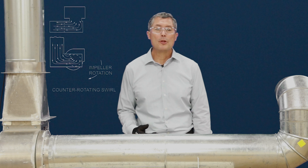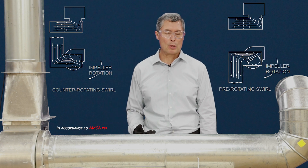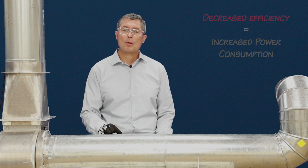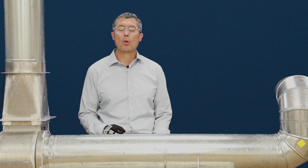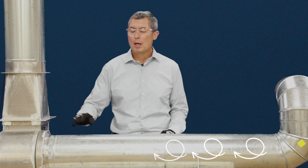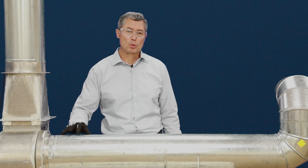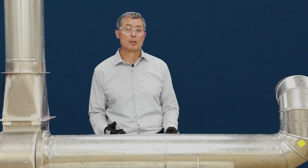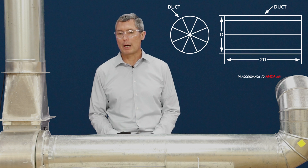Final thoughts on corkscrews. Corkscrew ductwork does affect the way a fan performs. If you counter-spin the air, you'll have much better performance than if you pre-spin the air. However, if you counter-spin the air, we just have to make sure that we compensate for that with a safety factor on energy consumption, because we are going to consume more energy. Straight runs of ductwork, while they typically help with fan performance, don't really work very well on circular flow patterns. So if we create a vortex going through the duct — air going in a circular pattern — we have to remember that the fan wheel is also creating a vortex. Not quite as strong, but it is creating one. As a result, it can carry vortexes through duct for very extended periods of time — I've seen carry as long as 300 feet. The only way to break that up is to put some kind of straightening vanes or splitter vanes inside the duct to help break that vortex, or to use some kind of diffuser in the duct.